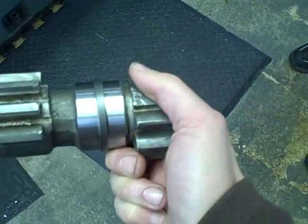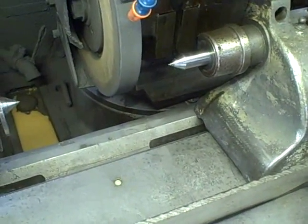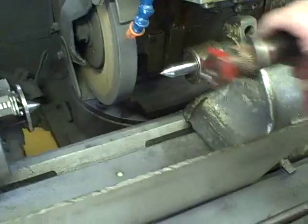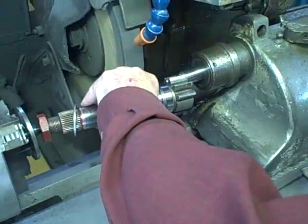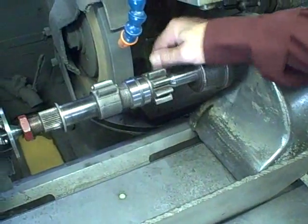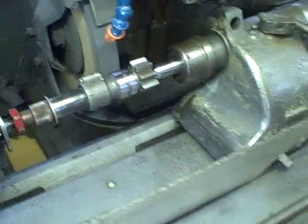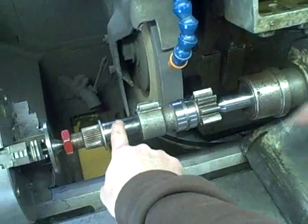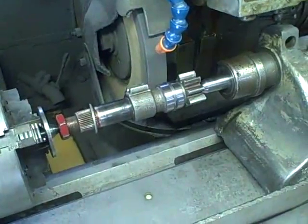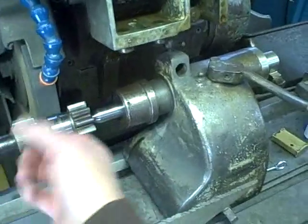So they took about 15 thousandths off. This is a cylindrical grinder setup and it made easy work of this, right? You can put it in just like this — this is how we ground it, right on centers. So it runs dead true to the centers. We took about 15 off of that. And you're saying it still runs out around a little bit? Yeah — I think that runs out about 20 thousandths. Okay. Because this is going to be in a bushing but it won't be able to move, and now that this is true to the centers I think it's going to give me enough clearance to make it work — to get it set up anyway.